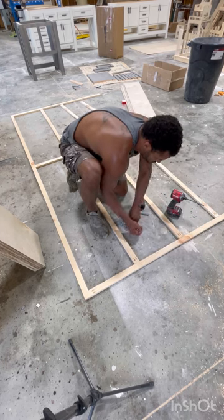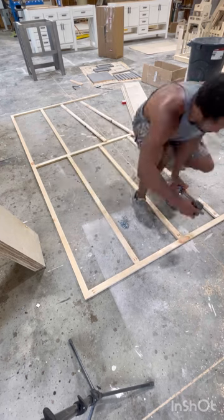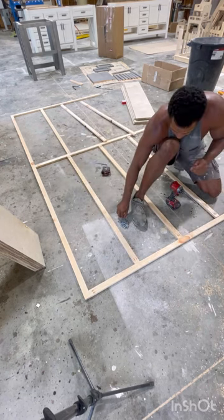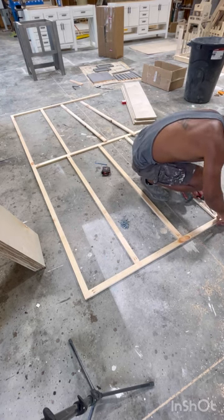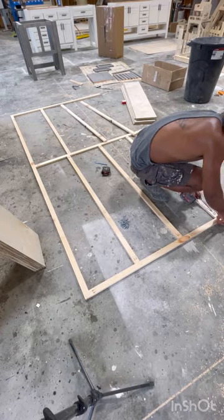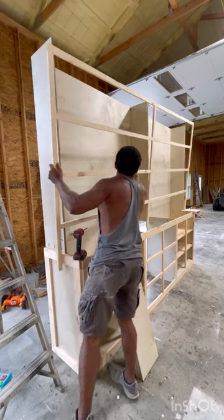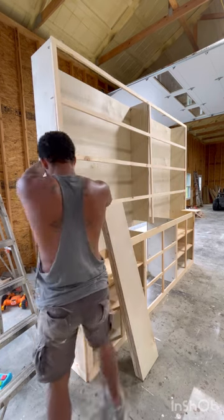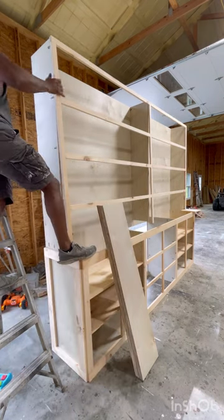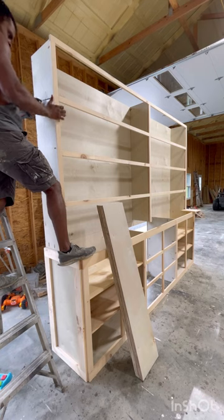From there I'm doing the face of the upper portion — the shelves, the top, and whatnot. This is just inch-and-a-half strips of pine. I did this first so that it'd be easier to do the shelf. More pocket holes to line these all up. I also grabbed another small piece of pine and set it underneath to really help get it level, then used pocket holes to attach the face.